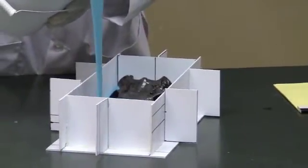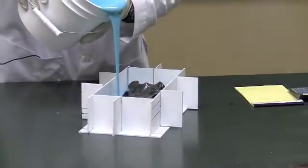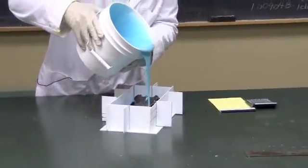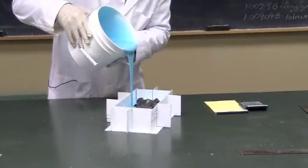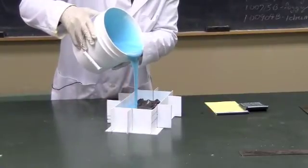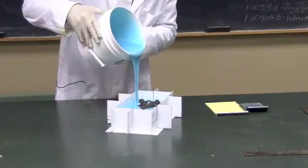Take my time here. You really just don't want to dump it over the piece. You want to gradually bring the rubber up so that you maneuver the rubber into all the nuances of the piece. Don't forget your silicone spray, because if you don't do that, it's a sure bet the urethane rubber will bond to whatever you're trying to make a master of.